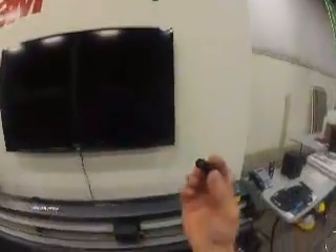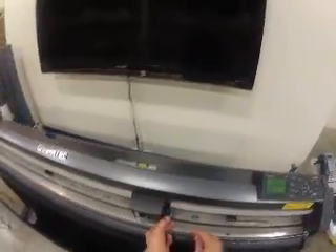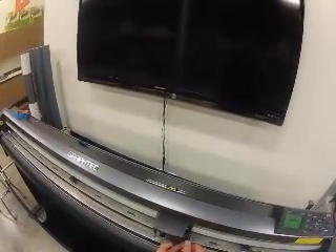When it goes and makes a corner or anything like that, you get nice clean cuts versus having that extra space where the material can actually drag or get caught up. I'm going to put this back in my actual cutting head — you want to make sure it goes in the back and then drops all the way down. When that's all the way down, you'll see you've got this lip that rides over the top of the actual blade holder. Go ahead and thumb tighten it, and we're basically set as far as the blade depth.